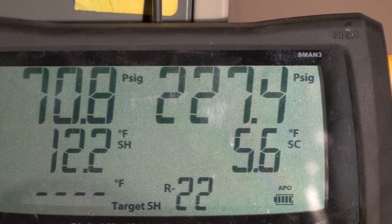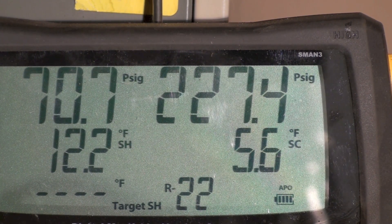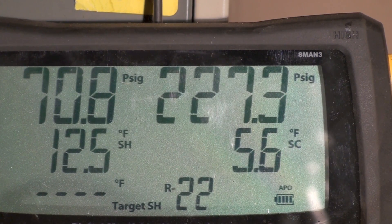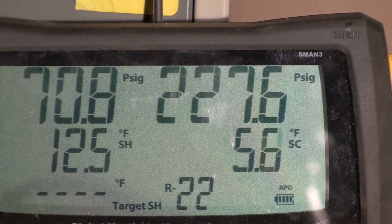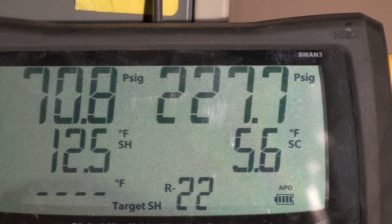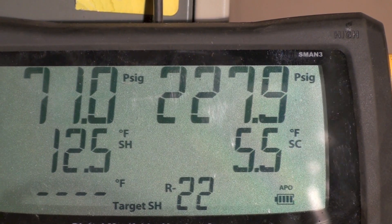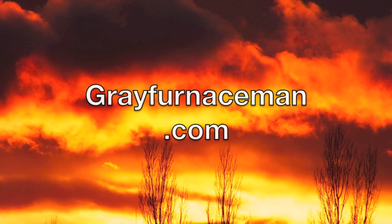What I'm looking for with subcool — without manufacturer's specifications — is between 5 and 10 degrees. We're a little bit on the low side of that but pretty close. This machine is actually doing pretty well, running about like I'd expect it to run. Those numbers are ballpark. We will have further videos showing low charge, high charge, locked expansion device, locked dryer, and so on. That's how superheat and subcool are measured.